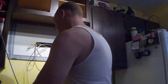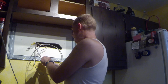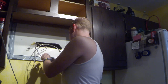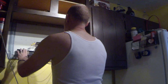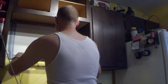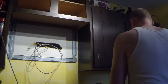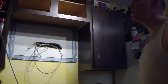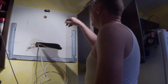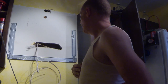I've got my other toggle bolt in place. This part is all measured up now. I have a little screw here that I just used initially right at the center to balance it and keep it in place. I'm going to pull that out and double-check to make sure it's still level. Perfect — right on spot. Now I've got my upper cabinet off again. You can see the holes that I drilled here for my wiring that's going to be coming through, and that's going to be for the outlet.